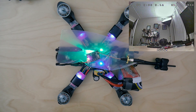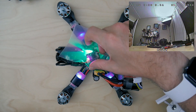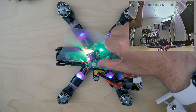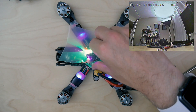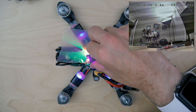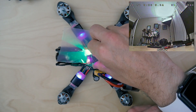What actually causes the lines in the video — I'll show you right now. When you hold the side of the VTX, it's going to be this side right here. If you put your thumb on there, this could be any metal. So if it's any metal, like the top of your frame, that's touching the side of the VTX, it's going to cause lines in your video. I've got my finger on those solder points. I'm going to go ahead and arm the quad — and bam, look at those lines. When you throttle up, it gets even worse. If I push a little bit harder, it gets even worse. And then when you disarm, it just goes away.